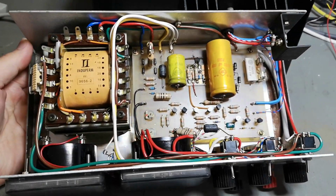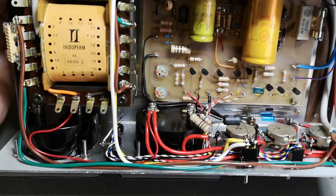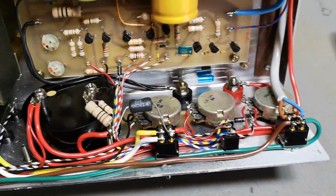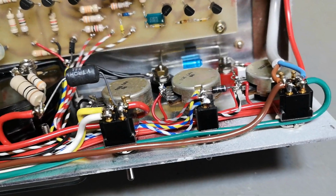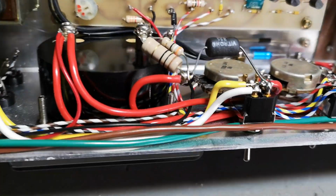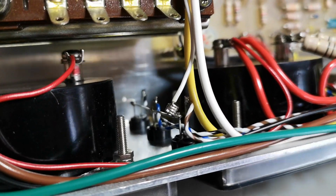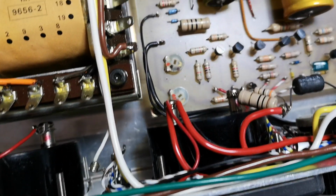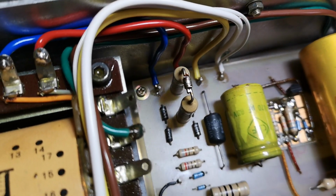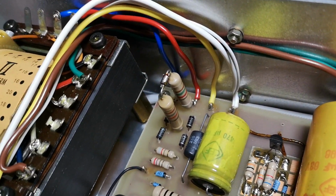See, this is very beautiful. Got a little bit of components mounted up here, but they're... Everything is mounted using pigtail technique. I kind of like that because this gives very, very good and stable solderings. Also see here on the top of the two resistors here in the middle of the picture. This is definitely how you do high quality solderings that will just last forever.